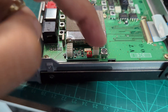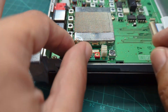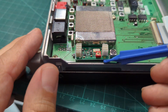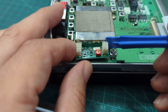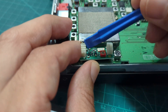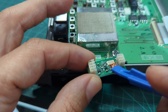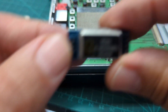This thing slides upwards and is called the oscillator board. I'd be careful — just carefully wiggle it off. It doesn't seem too tight. I've got one of these little plastic tools and I'm very conscious of the components here, carefully doing this with no power to the unit. There's the oscillator board — I'll keep this just in case we have a problem. The red adjustable trimmer was in this position, so I'll remember that.